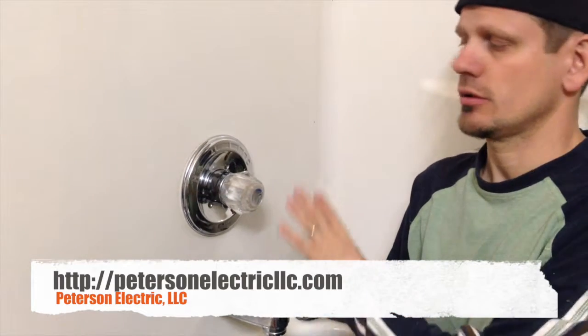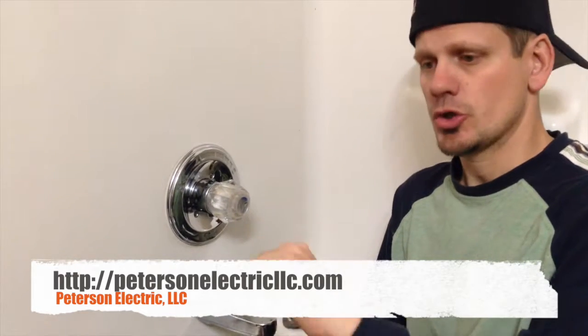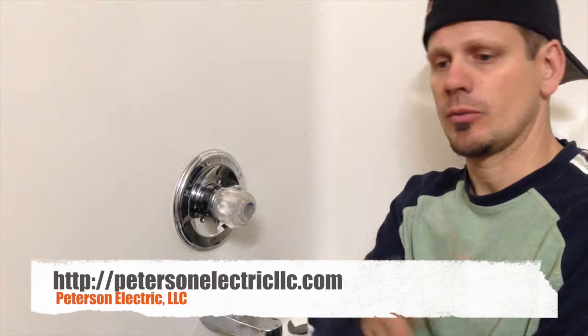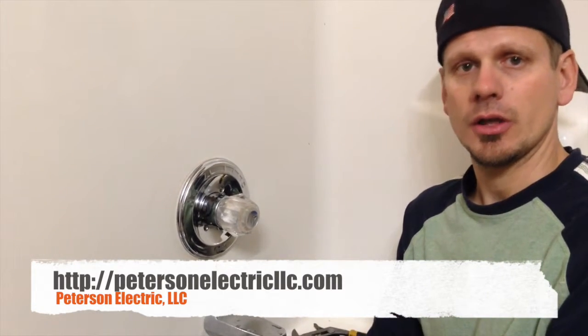Then after you do your sink, do your shower. It's the same concept. Before you start your dishwasher, go ahead and turn on the hot water in the sink. Let that cycle from the hot water heater up. That way when you fill your dishwasher, you don't have cold water getting in there to start your pre-rinse on your dishwasher.